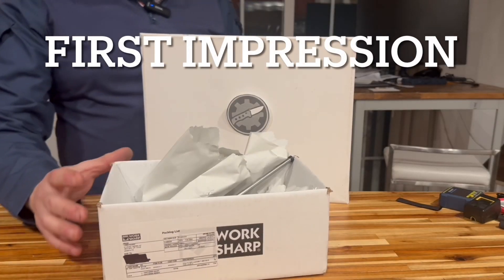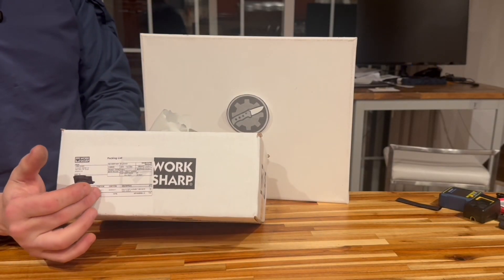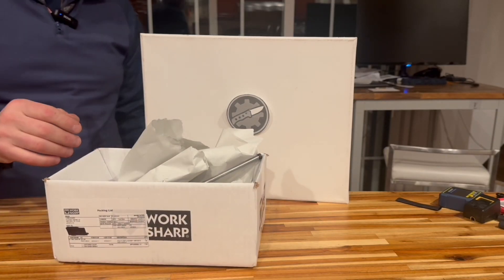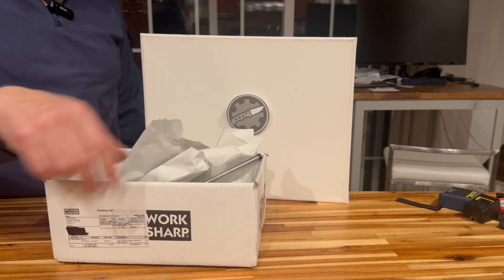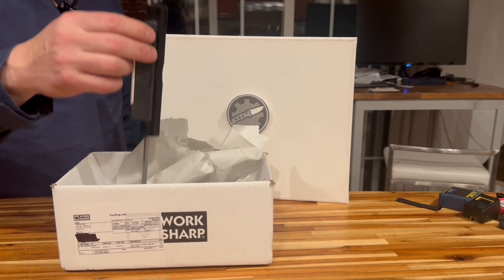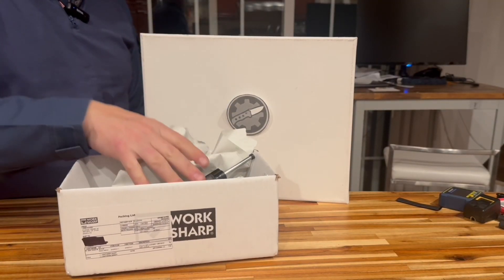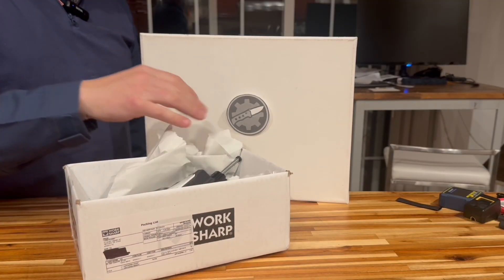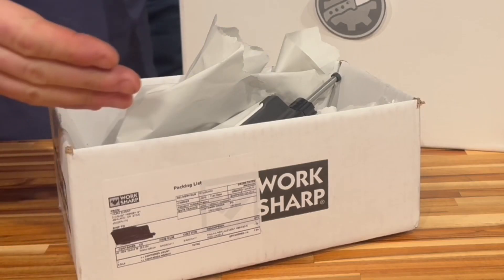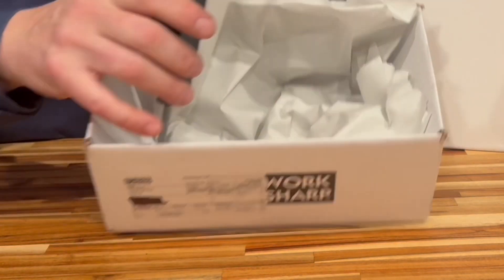But let's not worry — the fix is here, and tonight I'll share it with you. I ordered a brand new plate carrier from WorkSharp. Here's the purchase order glued to the exterior of the box; there's no other receipt. As you can see, the component is packaged diagonally in this rather large box. One of my viewers commented that his was binding, and I think the reason is because when it's packaged like that tightly in the box, any force striking this box diagonally — when it's dropped or squooshed between other boxes — may deform the rod, and that in turn will cause binding.